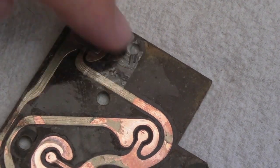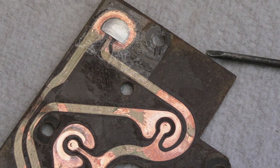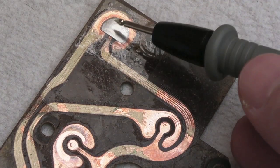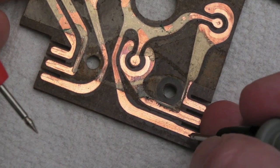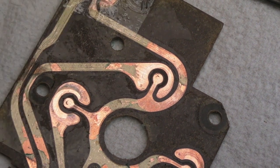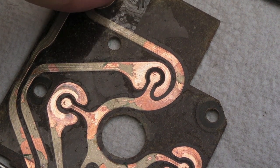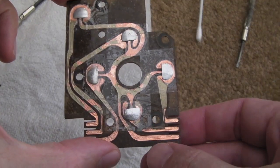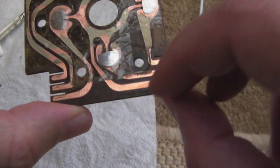I've cleaned up the domes, placed them back, and put a fresh piece of tape over each one, piercing a hole where the screw goes. Now I'll put the meter on continuity test. Following the traces — the center one and the outer one go down to a common point here. If I hold the meter on those contacts and press the button — you can hear it click — great, continuity confirmed. All buttons are now taped down with fresh tape, clean contacts on the board. I can crimp the wires back on and reassemble.